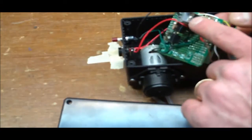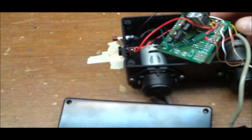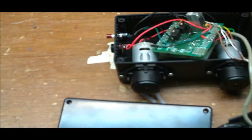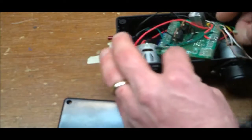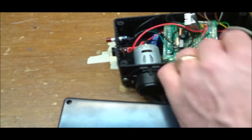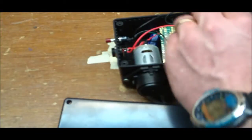I have a switch so I can press the button to turn the LCD backlight on and check the screen at a glance, rather than leaving it on all the time. I'm not sure how hot the regulator will get, so I put a small heatsink on it, and I don't want the LCD drawing extra power unnecessarily in the cabinet.